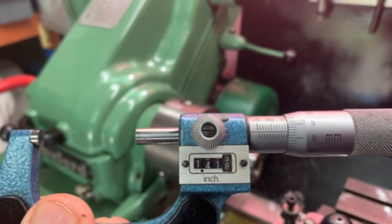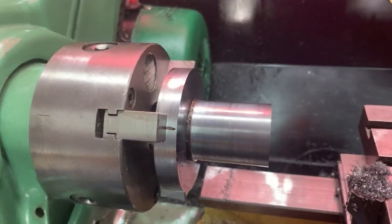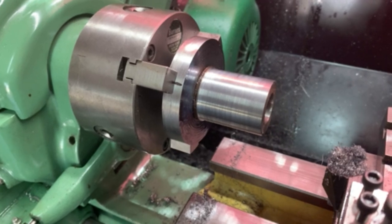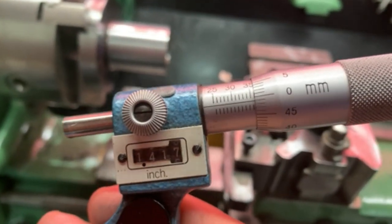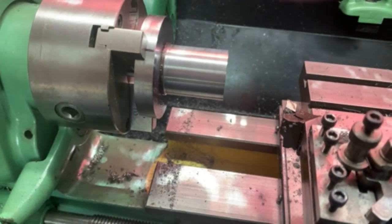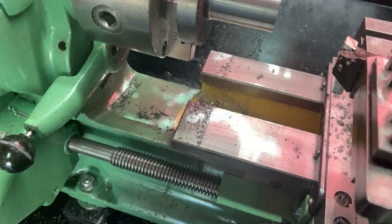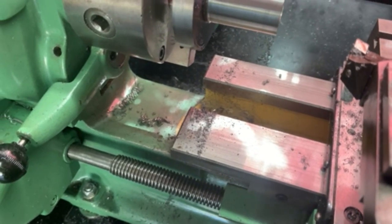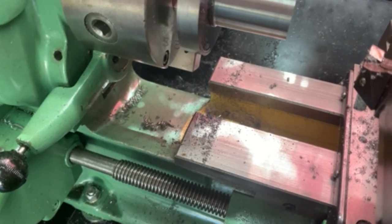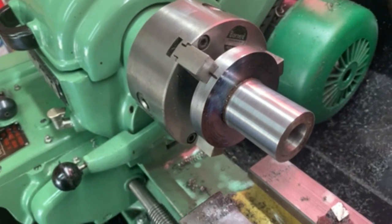Only about two points out, so we'll just use a bit of emery tape to polish the shaft at the end. That section of the job is finished and we're pretty well on size. I've given it a light polish and it's come up to on size — sitting exactly at 35.999, which is ideal. A little bit of emery to polish that last bit off. For those of you using lathes, when you've used emery, clean the swarf off the bed — small bits of emery will drop on there and cause wear over time. We're now ready to do the plate on the end.